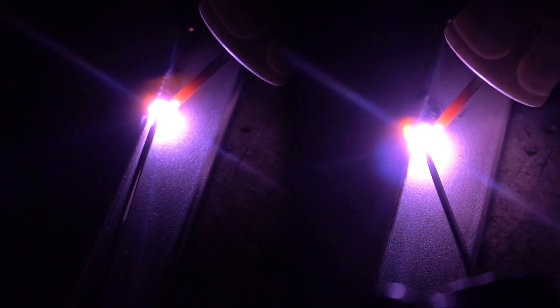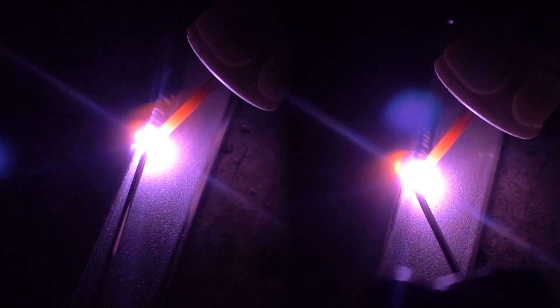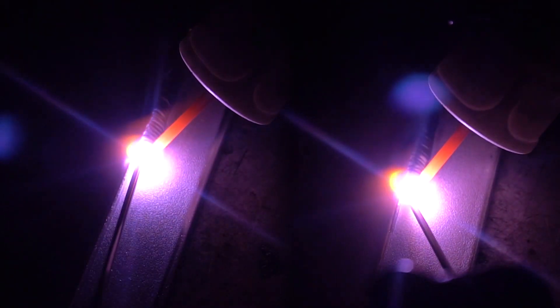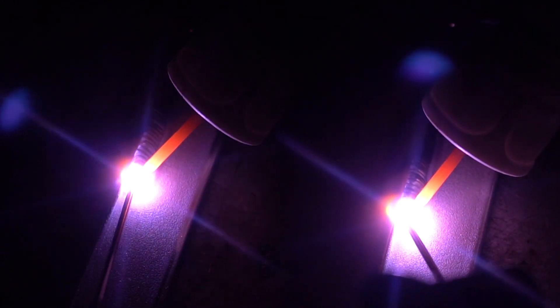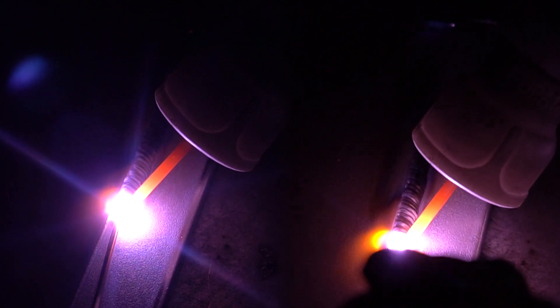Let's line up two coupons here. One of them is being welded with ER308 filler wire, the other with ER70S-2. Both are fired at 100 amps, both are 1/8-inch thickness, and they're both 304 stainless steel. Which one is which — I'm going to leave that a mystery. Maybe you can figure it out, maybe you can't.